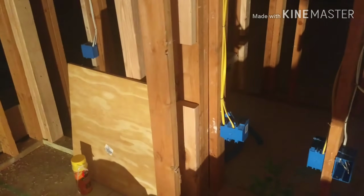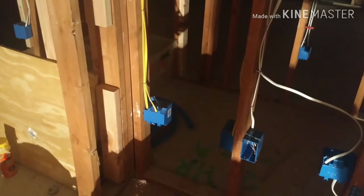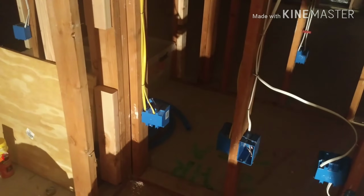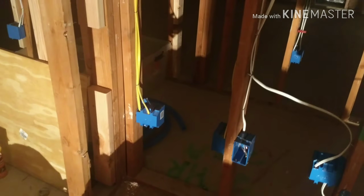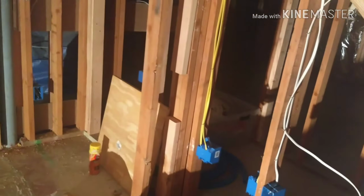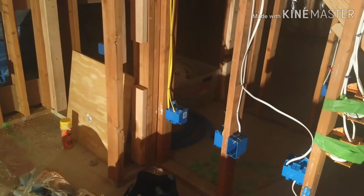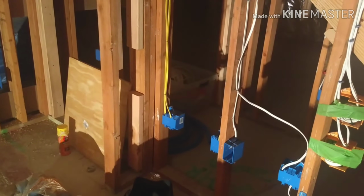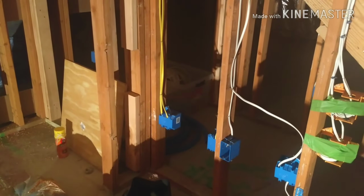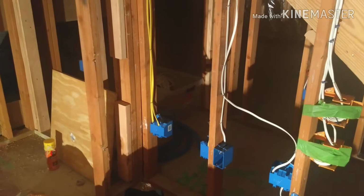So the reason we have the 2 20 amps is what's going to happen here is that one of the 20 amps is going to plug into the UPS, and the UPS is where the projector needs to be plugged in. So if you look at this, how are we going to do this, right? The projector is here and the 20 amp is there. So how do I plug in a UPS into the 20 amp circuit and have the projector plug into the UPS to get it driven from the 20 amp circuit? So that's where we installed this dummy run.